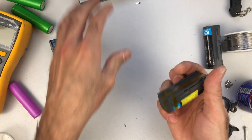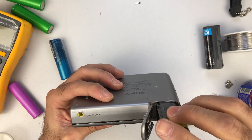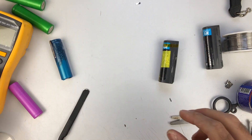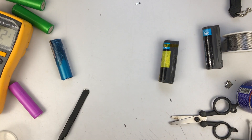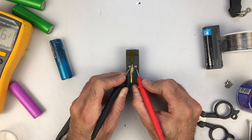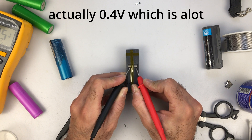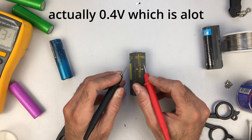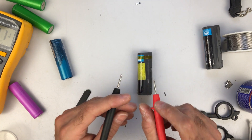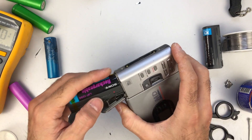This is just temporary to test it. Let's test it with a multimeter first — 3.7 volts. If you noticed, there's a voltage drop of about 0.3 volts, which is basically due to the diodes that are in the circuit inside of here. So let's try it on the player.